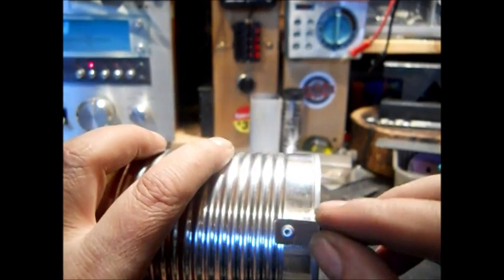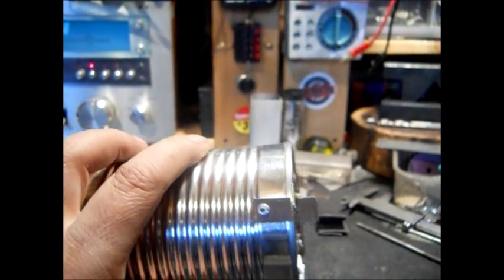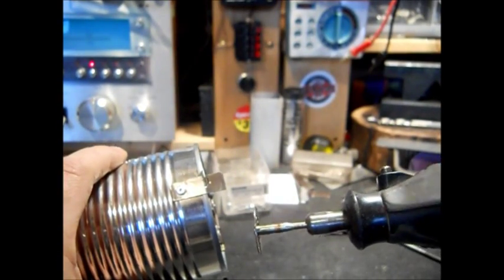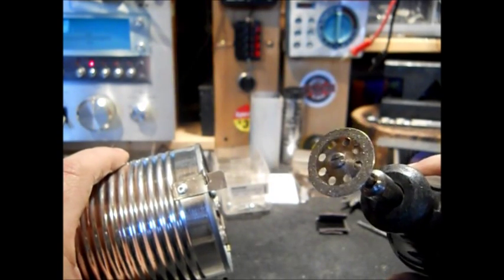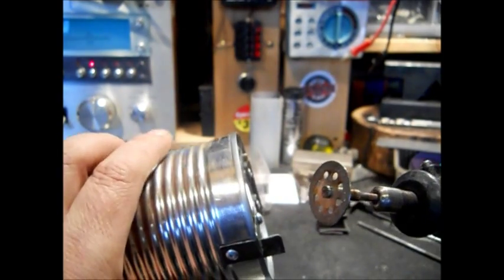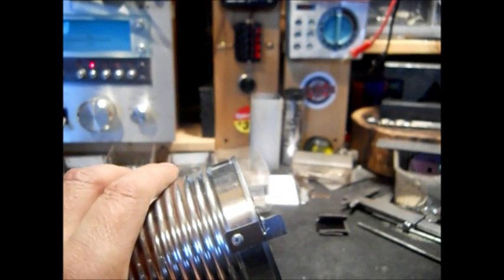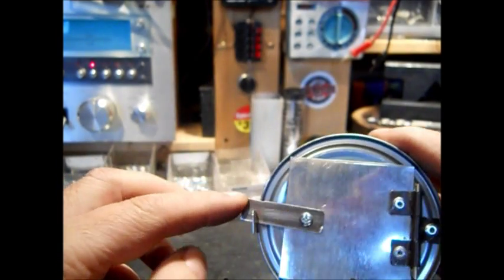Any kind of tin will work. I have a diamond blade from my Dremel. I cut a lot of tin with. These will cut a lot of tin. Just be careful, don't abuse them. I have 2 of these, and I've used them for a long time. They're hard to get started because the diamond stuff is on the sides and not on the edge. So it takes a little burning to get started in the tin, but they last longer than cutter blades. If you ever use the Dremel, you'll know what I mean.